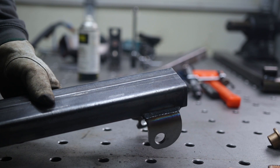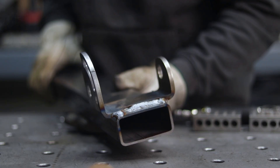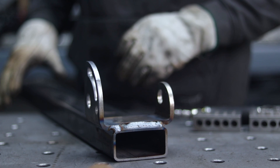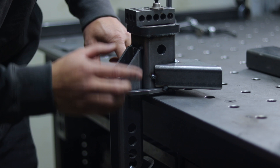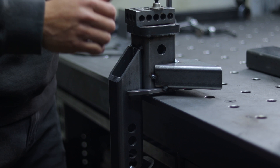We've fully welded it all the way around. When you weld it, the heat is going to want to make the bracket bend outward — that's not really a problem, because once you get your hinge piece back in with the bolt and nut, you'll be able to cinch it back. Also, the first thing to do is jig up the anti-wobble assembly we tacked earlier — the anti-wobble overhangs off the table while the auxiliary hitch sits flat against it. Clamp it down, then we'll move on to attaching the fixed arm to the 45-degree offset tube.